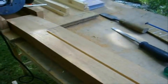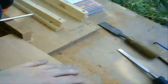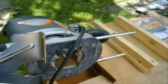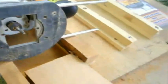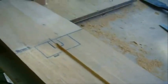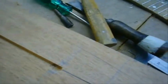This is the first few sweeps of the truss rod channel. I'm using the router with a side guide which follows the side of the neck — I leave it in block form so it follows the side just going up and down. You gradually increase the depth with each sweep. The router cutter I'm using is 5mm, a straight-forward cutter — you go about 10mm down, straight down the middle of the neck. Then you route the adjustment cavity in the headstock and also the little stopper on the side. This is the Gibson truss rod I'm using — there's a stopper there which will fit in, and the adjuster goes up this end.